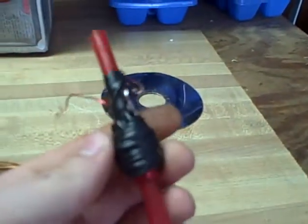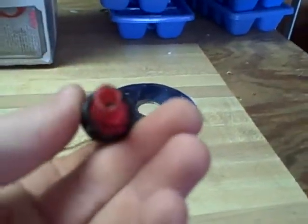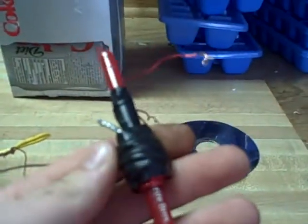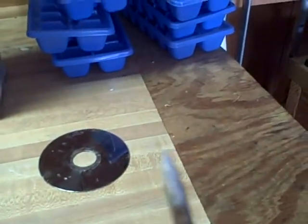I've also made a small coil gun coil. It's kind of rough right now but it works. I'm not sure how many turns it is, but it's the same gauge wire as the disc launcher coil — about 16 or 14 gauge enameled wire. It's over 100 turns, I know that for sure. These are the projectiles — they're just ground-down nails. I sharpened them up a little bit and ground the heads off.